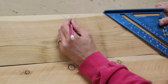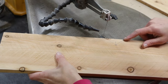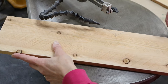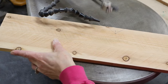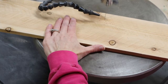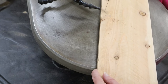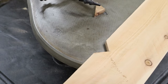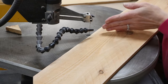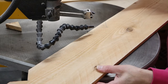And then this is what we're cutting out. On my scroll saw I'm going to cut out our little triangle pieces — a bandsaw would work, a jigsaw would work, whatever you have will work. A little tip: here's the line that I need to go to. Make sure it is straight, because we're really just pushing the wood in straight and then retracting it in a straight line as well.